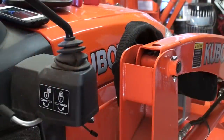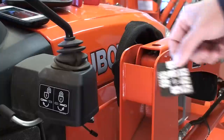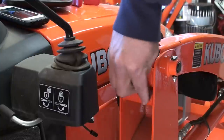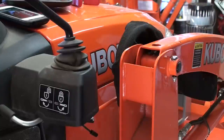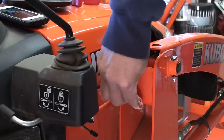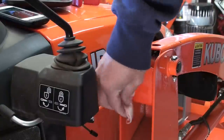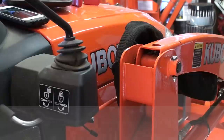On the right side I had to remove the FEL control sticker and get that cleaned up. I've done a little scuffing here, taking off the shine, and did a little solvent wipe. Make sure you get all that gum from the sticker off and let that flash off — now we're ready to go. If this doesn't hold to the paint and I tear the paint off, then we'll bond it back onto the bare metal.